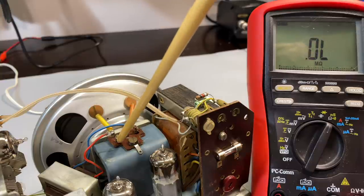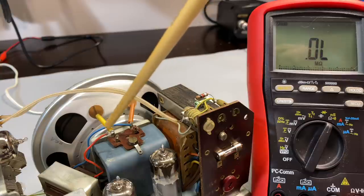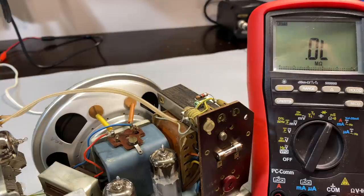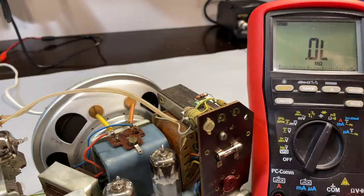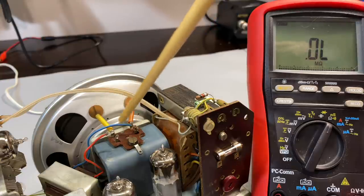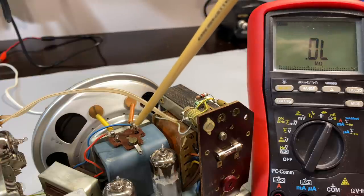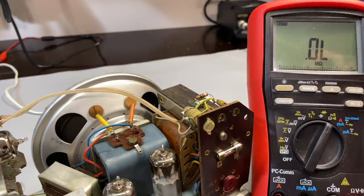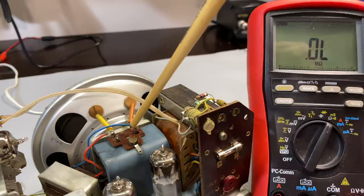If you look at, I think it was the last Mr. Carlson's lab video, I had the idea that this was true, but it took hearing it from him to give me the courage to do so. You can test a secondary without it being connected to a load, provided you don't have high levels of audio output. So that makes it easier to measure on a voltmeter, an AC voltmeter. So that's where we'll be measuring.